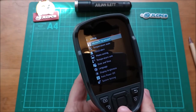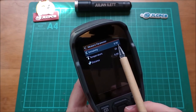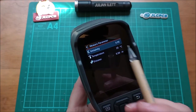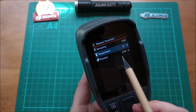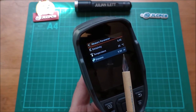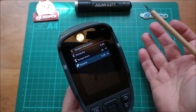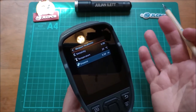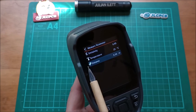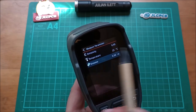Under measure parameters: emissivity can be left at 0.95 — some materials differ, but you get into complex areas like reflectivity. Temperature is the ambient room temperature which can affect readings. Distance is how far you are from the object — I've set mine to half a meter. As infrared energy disperses through the atmosphere over distance, the camera applies a slight modification to the temperature reading to keep it as accurate as possible.